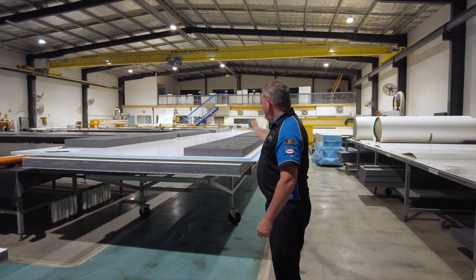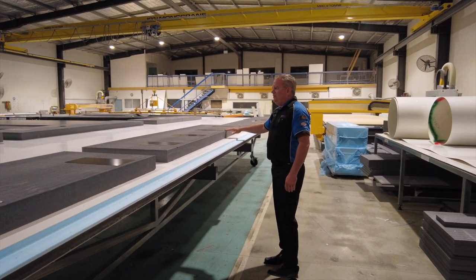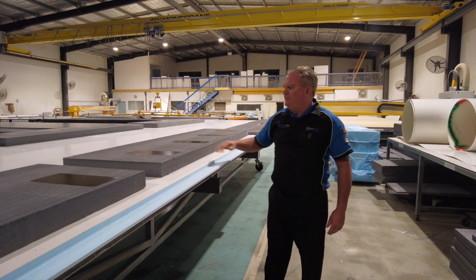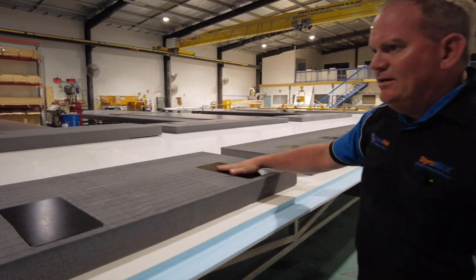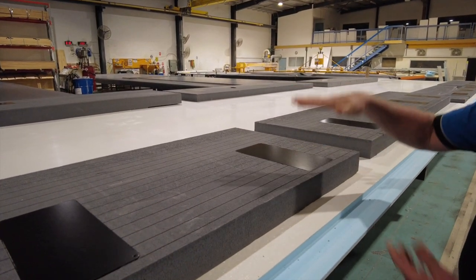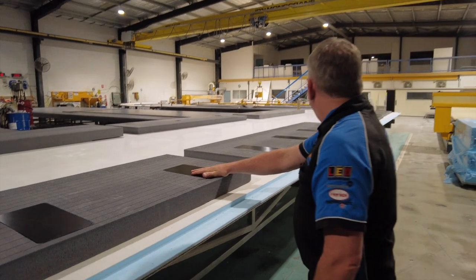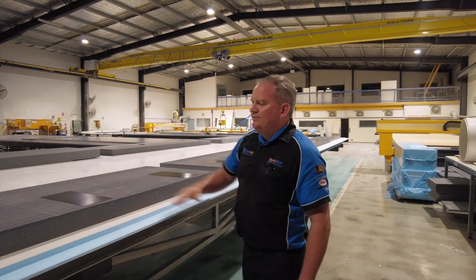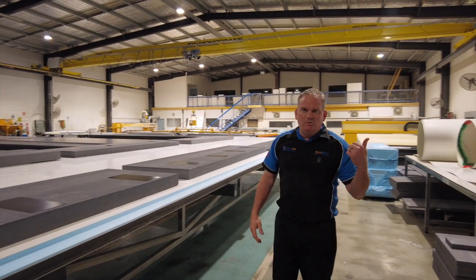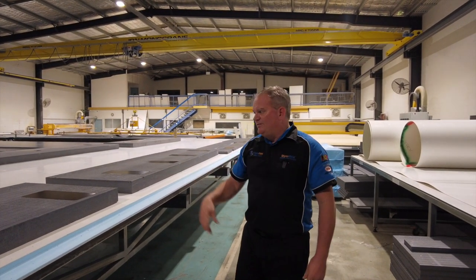They've got the foam for the rear doors of this build — Styro Plates getting pre-glued into the foam panel before we skin or laminate them. This is the same process done in the sidewalls of your RV — like next door with Brian's truck where the awning is going on the side. The same plate is pre-glued in and then the following day they'll laminate either side of the Styrofoam.